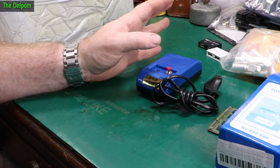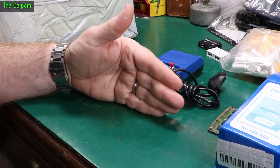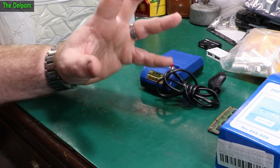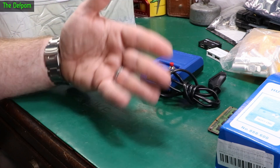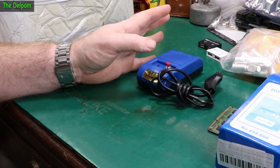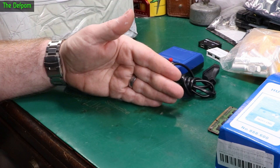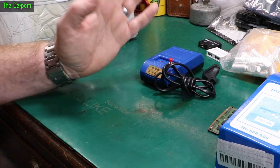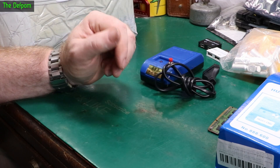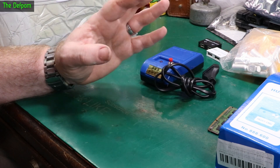You can change it so that currently from factory, the defaults are being turned on in AC mode. One of the things you can do is change the firmware so it defaults to DC, which is much more suitable for most cases for people who tend to buy these things. The other thing you can do is go from 2,000 counts to say 6,000 or potentially 10,000 counts instead of 2,000. So that changes ranges less often — it's a bit more versatile. Unless you do zeroing — if you zero it, then it's still limited to 2,000 counts. That's a bit of a firmware quirk. But part of it is you actually recalibrate it.